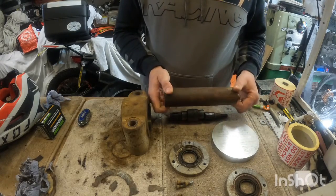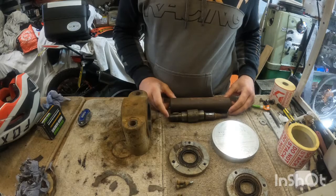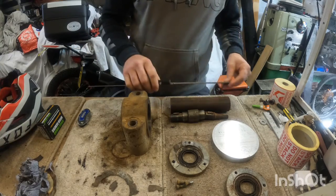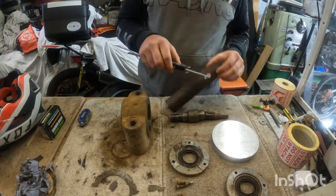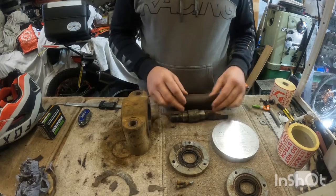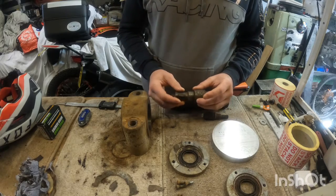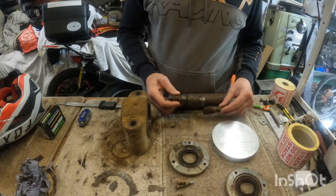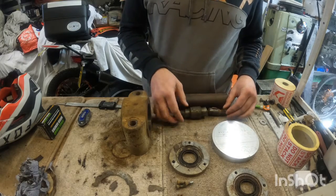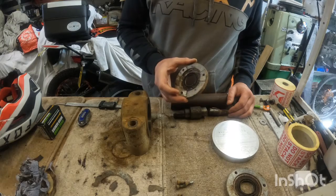I've got a stock bar here of some EN 24A grade steel. That is, I believe, about 200mm long by 50mm wide. So I'll be machining that down to an overall diameter of 38mm first, and then from that point I'll be working in all the features of the part onto this shaft. And once I've completed this shaft, then I'll move on to the lathe and possibly the milling machine for making up this seal flange.